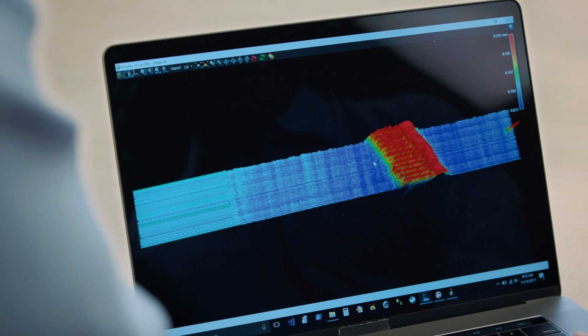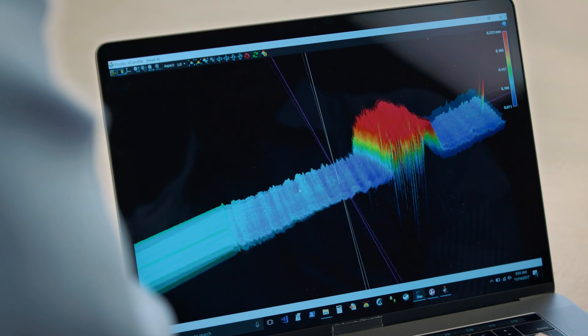This thing has something like 1,626 layers to it, and you're just pointing at a small fraction of one layer in this picture. One single layer from this sensor is millions of points. So you multiply that by your 1,700 layers — you're going to be talking about billions of data points. Collecting all this data, you're talking terabytes of data potentially per build. Having a strategy for how we collect that data, where and how we process it, how we store it, what we store, how long we store it, and the accuracy of that data could all be really important dimensions of the problem. I think what we're going to see is that research will identify exactly what needs to be monitored. Then the trick is going to be how to capture that and distill it in real time down to a more manageable size that can follow along with the part. Interesting times.